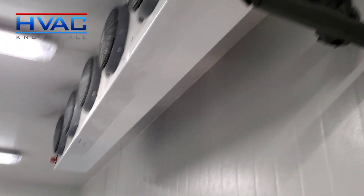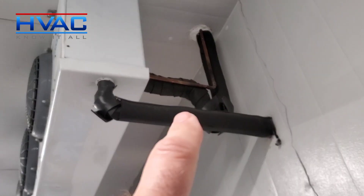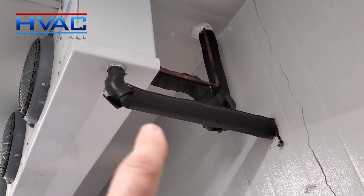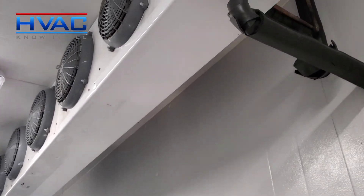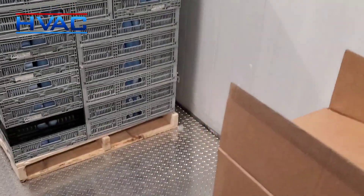Here's the pan we're changing. We can also see the suction line is not insulated very well, so we're going to have to fix that. We're also going to have to pull the insulation off the drain — that's not done very well either. We'll cut into this drain line, remove the pan, and bring it down. We've had issues with leaks happening in different places because we're finding water on the floor.